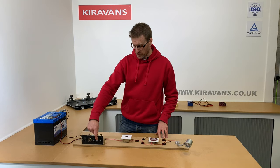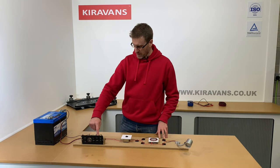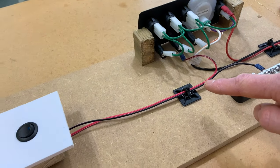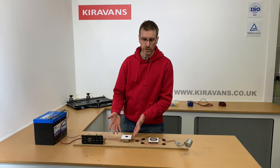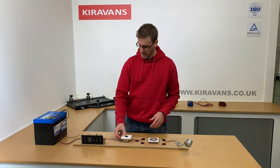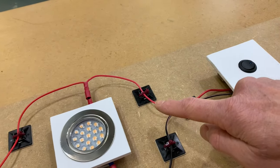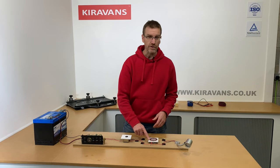So in this one we'll turn on our lighting circuit, and then from the back of that we've got a positive cable which runs along to our little rocker switch — this is totally optional but I thought I'd put one in. Then from the rocker switch the positive continues on to our first LED light.